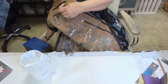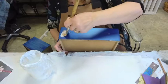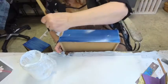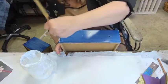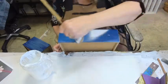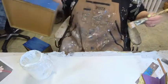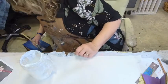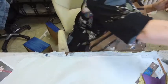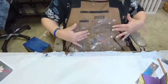All right, we're going to set that down and we have our final drawer. As you can see I don't just brush it on — I work it across the surface. You want to stretch the product across the surface; it gives you a chance to get it smoothed out and get your brush strokes going the way you want them to. That makes for a nicer finish in the long run. We're done with all three drawers and I need to put the adhesive brush somewhere I'll actually see it.